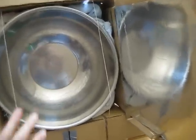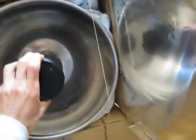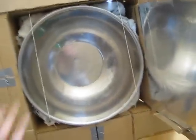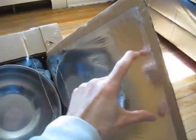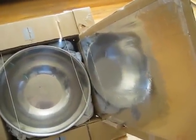It's almost useless because the sunlight will be reflected off — and this is not a perfect reflector, so some sunlight will be turned into heat, which will conduct through the bowl to the jar. But a lot of that heat will just be lost to the surrounding air and to the back. So what I realized is I don't want four reflectors at all. What I want is a whole bunch of reflectors that are the width of the jar — basically a comb. So the next step was to figure out how many segments I'll need and how wide to make them.